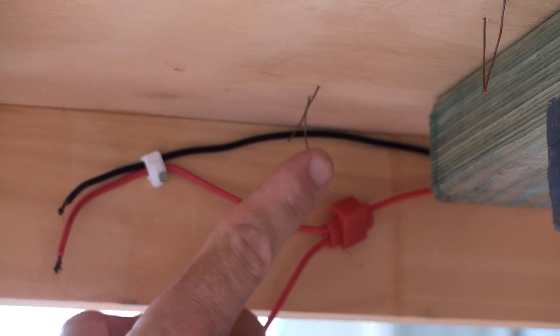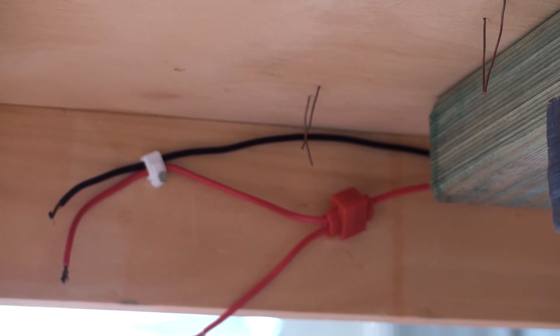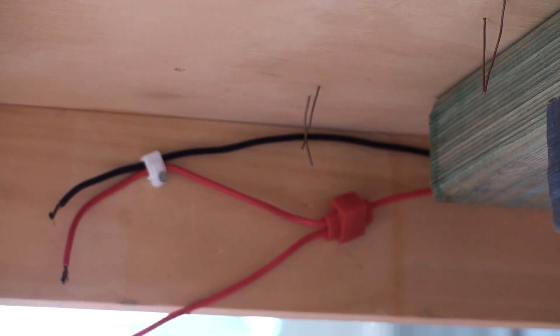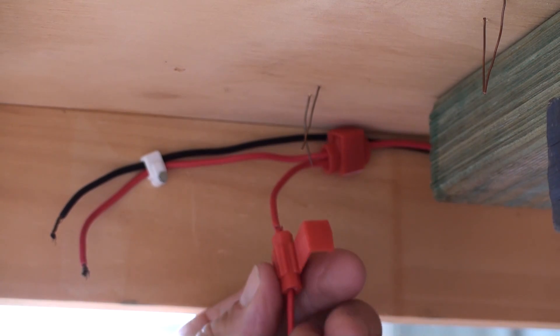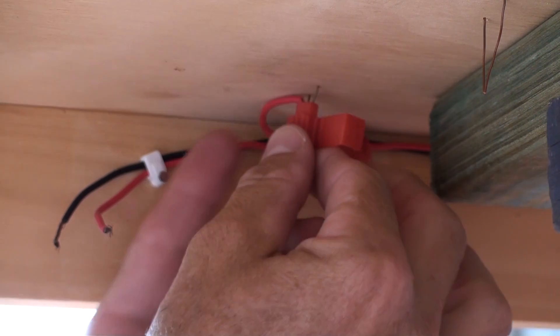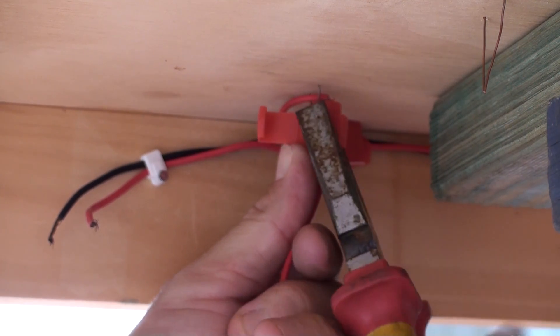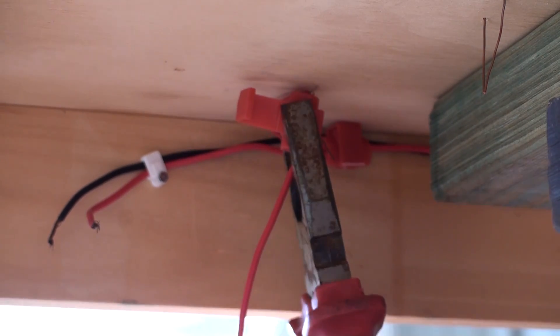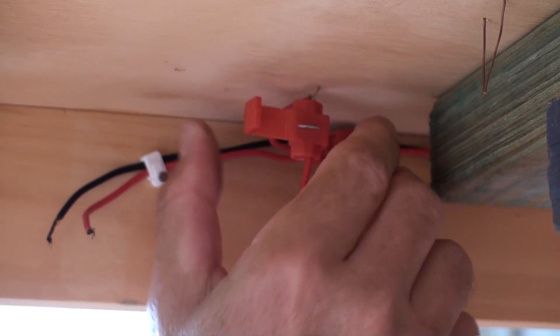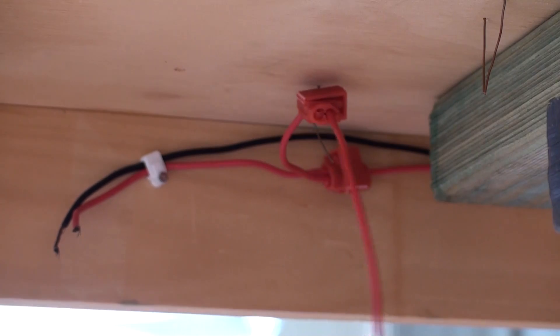Another thing I usually do is trim these down to about 20mm long, just so there's not too much copper hanging out that's exposed. Basically this wire, because it's feeding these, becomes the bus wire. That goes right the way through and then we'll travel on to the next one. Meanwhile this one here will slide up onto there and I'll close that off. There you go — we've got a good connection there. Done. Now that'll move on to the next one and the following one over there. And that's now got power.